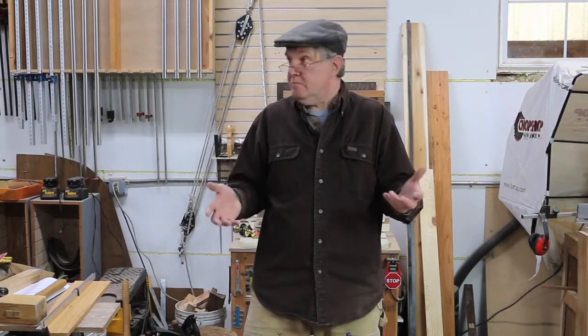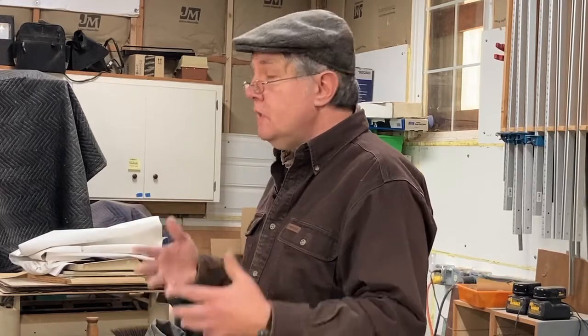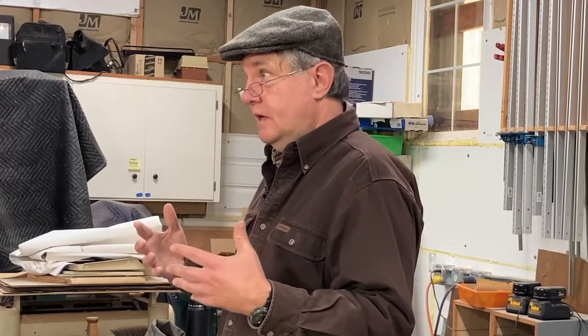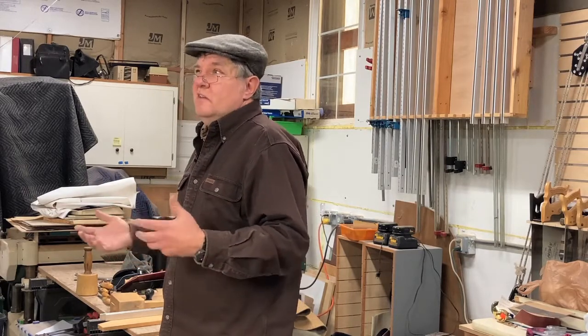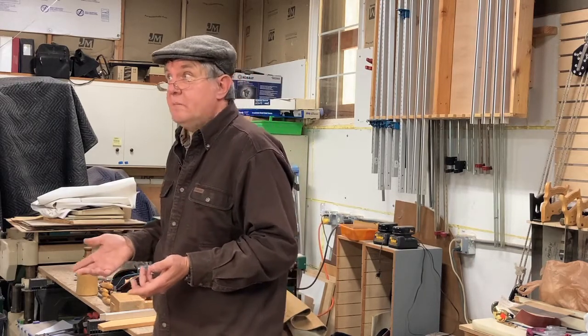And you think about it and you say, no, of course not. There are definitely some places where you have joinery coming together where you need all the accuracy and precision you can get. There are places that are going to be displayed prominently within the piece where the looks of the saw cut might be important, such as the shoulder of a tenon. And there are some places, especially in the construction of the piece, where you just need to get a saw cut that's kind of close to where it's going to be, but you're going to make a final saw cut past that anyways. So we're looking at saw cuts in terms of sort of a coarse, medium, and fine.